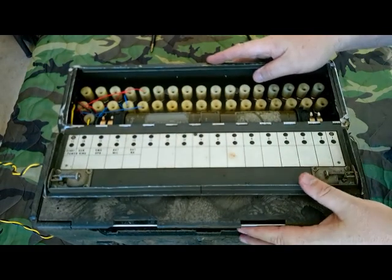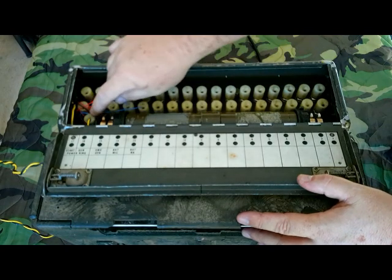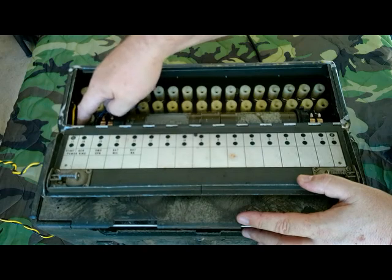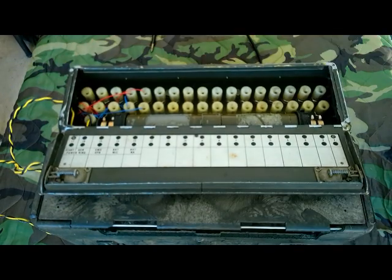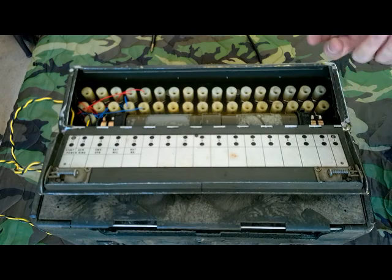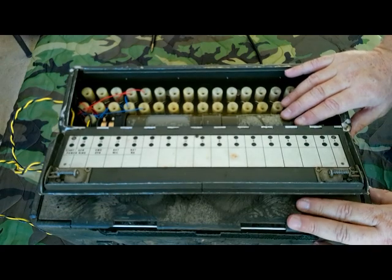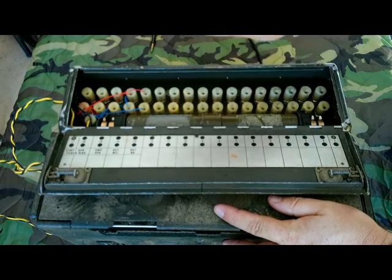This is the primary unit. You can see it's got the line pack in and these wires still connected to the night alarm. One of the major things you have to do is find this piece of wire and plug it into the night alarm button — it's not labeled but has a little marker. This brings the ground lug and the night alarm lug out. When you receive a ring and the indicator eye pops up, it trips the little switch inside, causing a short between ground and the night alarm, which sets the night alarm and operator pack off. Since we're not going to have a battery or operator pack in the stacked unit, we need this wire to get the ring signal to the night alarm in this unit.